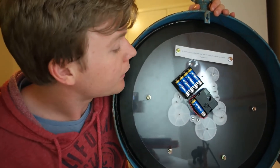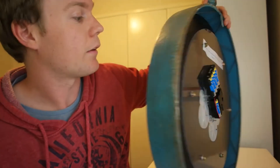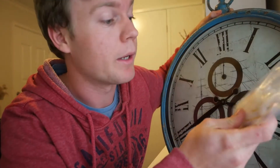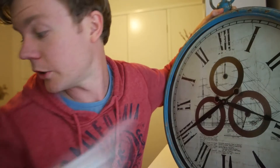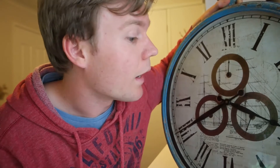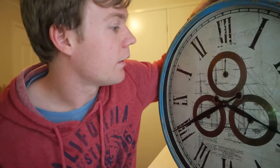It's a bit tricky getting to that number, especially because I've only got limited gears with a certain number of teeth. I bought packs like this off of eBay — very cheap, with a bunch of different sizes. I made a spreadsheet on the computer, put in the ratio I wanted, and it gave me the combinations that would get me there or near to it. I couldn't get exactly to the ratio I wanted, but I worked out it was quite close — within 45 minutes every year, which is not really significant on the years hand where it moves extremely slowly.